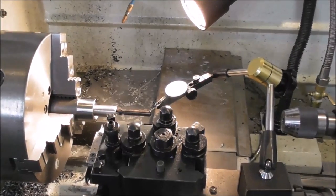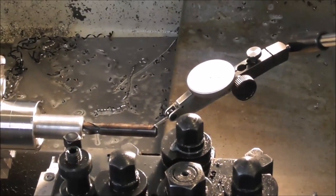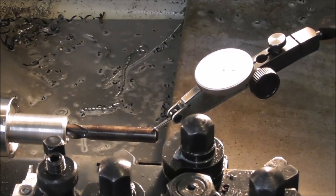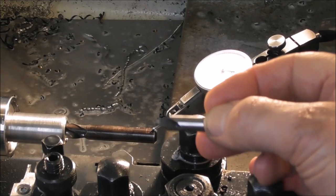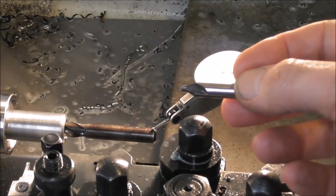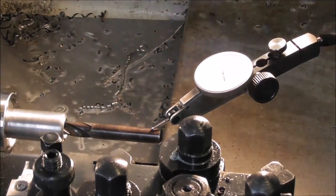If you've had a look at my bench grinding tool sharpening videos, I go over the importance of grinding a twist drill cutting edge centrally. It's very easy to drill a hole that runs out and doesn't run true. There are a couple of tricks to getting it running true: one is that your drill needs to be ground really accurately. The other is that your spotting drill — the one you're using to start the hole — needs to be started very gently so that it doesn't develop a runout. Because any runout at the beginning of the drilling operation will soon project itself into further and further runout. So get that spotting drill very gently started and running very concentric, otherwise you may not realize that the hole has wandered off and you may be making reject parts.